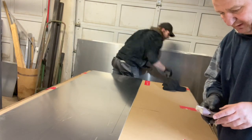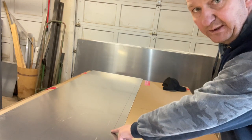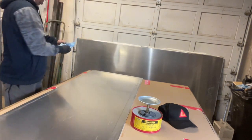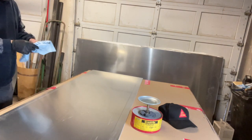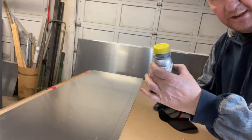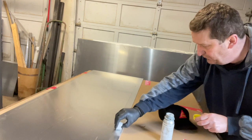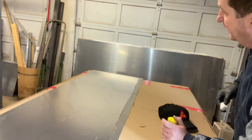We will explain step by step what we're doing with the panels. First of all, we are sanding where we have marked — you can see the lines right there. We will sand and roughen the surface. As you can see, this is all from our sanding paper and the aluminum chips which come off through the sanding process. Next, we take the activator, Sika Activator 205, and a little sponge. Pour a little bit in here. Now we let this flash off for 10 minutes minimum.